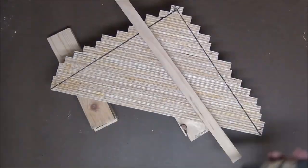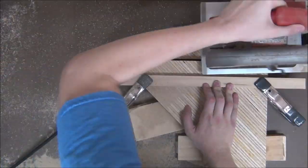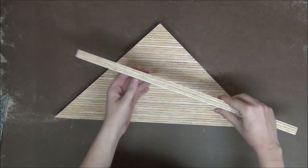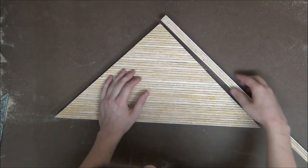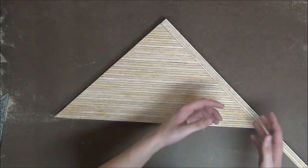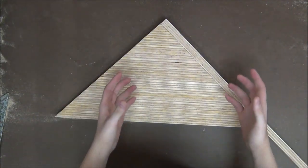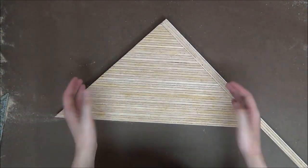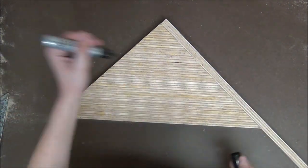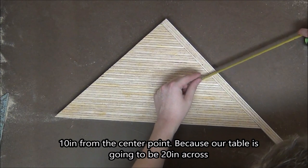After that I'm just going to straighten out the edges with a circular saw and we'll be ready for the next step. Now here comes the fun part — we're going to take the rest of our strips and start gluing and nailing them anywhere and everywhere we want. The more random and unpredictable you get with it, the cooler the finished product will be. But this is going to be a table, so don't build up — keep it as flat as possible. When we're done we're going to cut this whole piece into a large circle, so to minimize wasted material I like to choose my center point now.